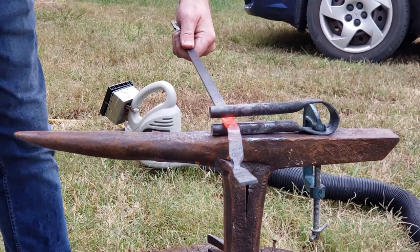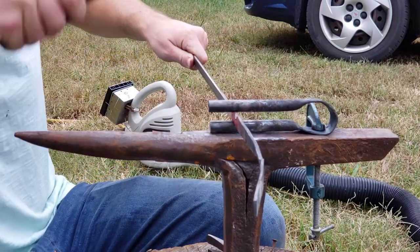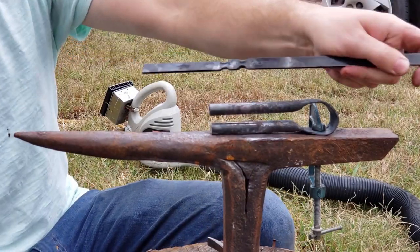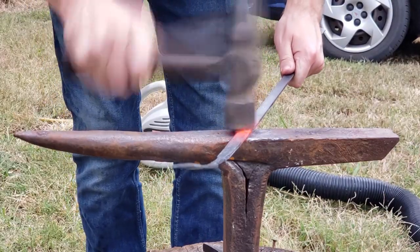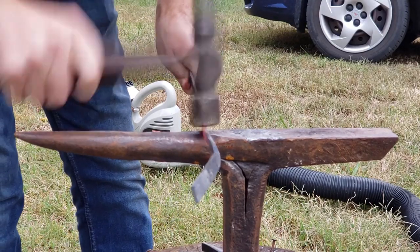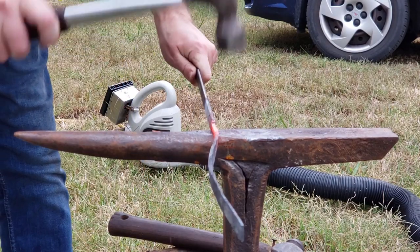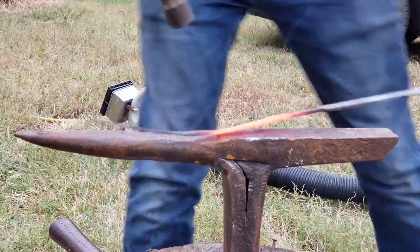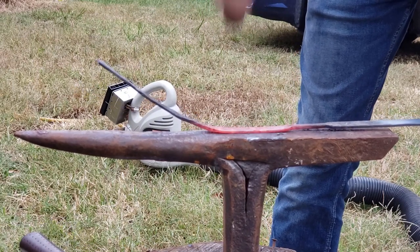There will be two straps that encircle the scabbard and hold suspension rings. I started by using this shitty swaging tool to isolate a short section of material. I drew that material into a roughly octagonal rod. That's the section the ring will go around. Last thing I did while I had the forge going was flatten out the rest of the stock. The rest of the work could be done cold.